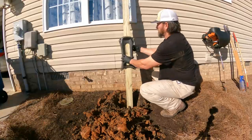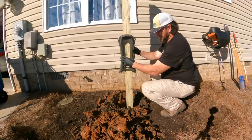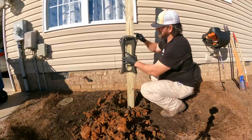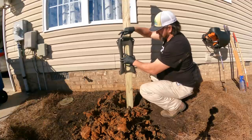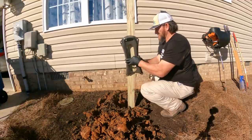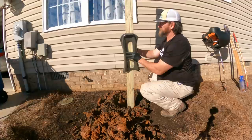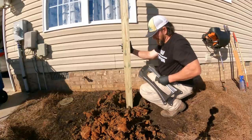I'm gonna take the mount itself and hold it up here so I can get a good idea about where I want the height to be. I know a lot of times people mount them down low, but I want mine a little higher simply so I don't have to bend over as much. I don't want to go beyond the arc right here for aesthetic reasons — I think seeing that round curve at a distance looks better than a pole sticking up. I think that's about the height I want. I'll go over and cut the four-by-four.